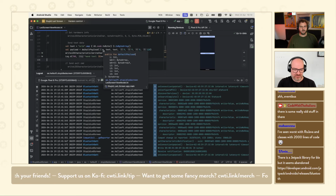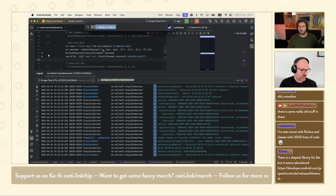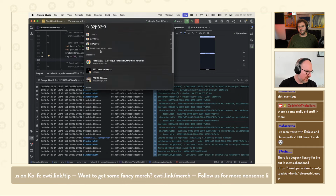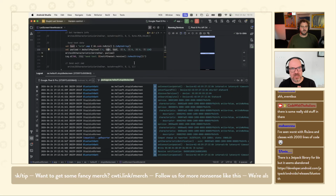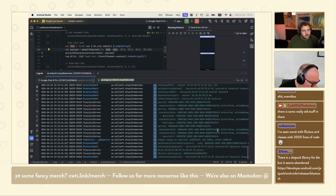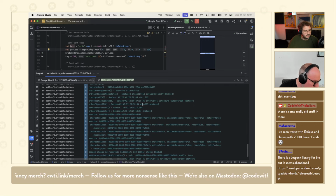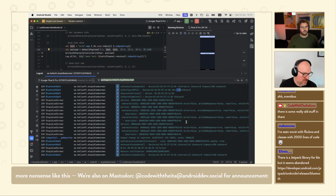And, yeah, I mean, 32 times 32 times 3 is 3,000. 3,072. Yeah. So then you have to split that up, and I think the maximum transfer unit here is 517. Yeah, I think it requests that. I think it's 515. Okay. So you can send 515 bytes at a time. Probably because there is a fairly new Bluetooth chipset in this one that supports that big one.